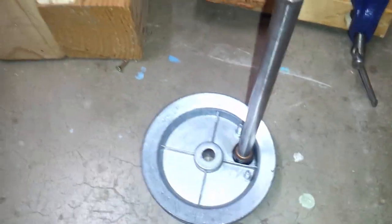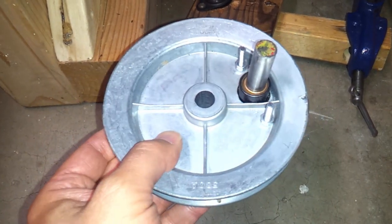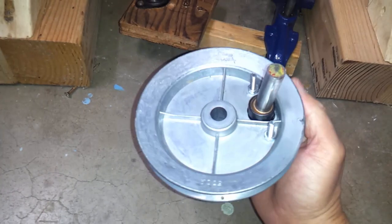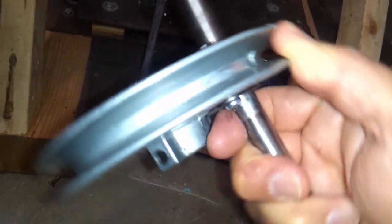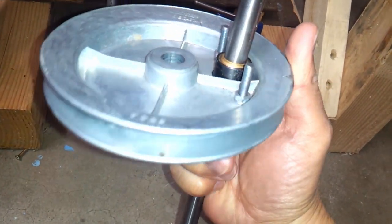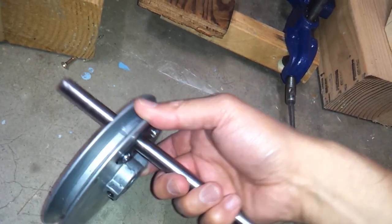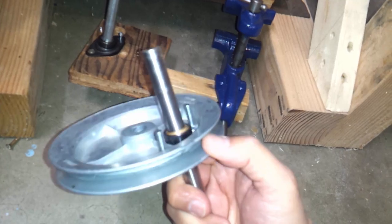So if you have this in here and you want to drive the lower shaft in an elliptical orbit, what you do is tilt this at a few degrees, and when it's rotating like this, it will trace an elliptical orbit. It's the easiest way to create an elliptical orbit from rotary motion, because it's all about frames of reference. I can see this can tilt back and forth — it has that much play. I want one that has quite a bit more, to where you'd be able to turn it to 45 degrees, but there's not enough give there — it only gives me a couple degrees of tilt.